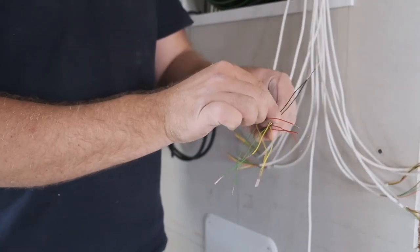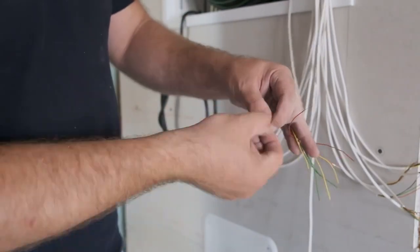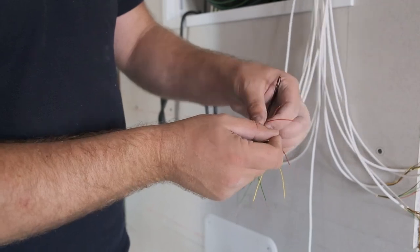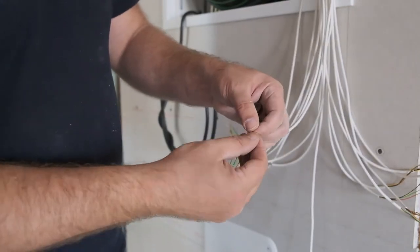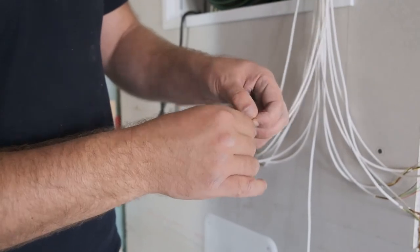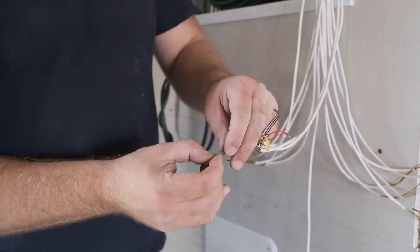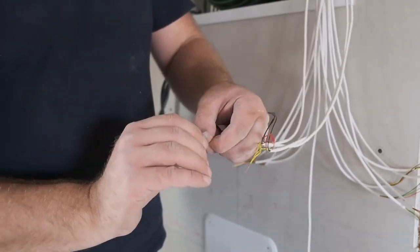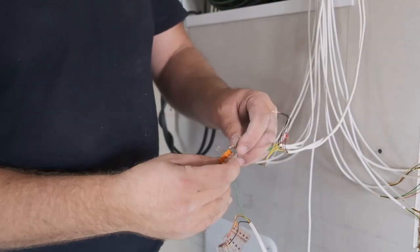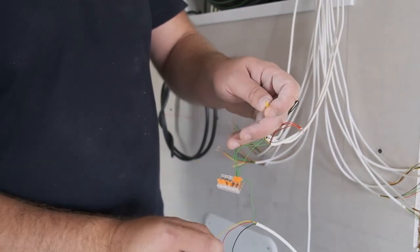Interconnect the wires of the same color from all sensors and, using the supplied Wago clips, lead one of the cables to the converter, which should then be connected to the computer via a USB connector. You will receive the installation manual and sensor testing program via email, or you can download the necessary documents in the user account. Using the given links in the manual, specifically in the testing preparation part, install the Java program